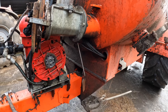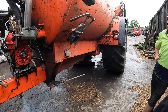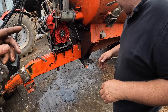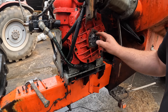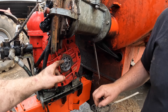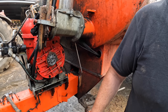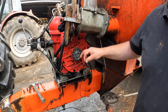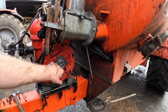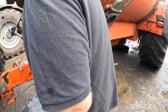That oil in there is the oil that gets circulated into the pump. It goes into the pump through the bearing - well, it comes in there, that's driving that. But it also lubricates that bearing, so when she starts up that's going to oil it again. It's not something that has to be quite tight there. Right, circlip pliers.